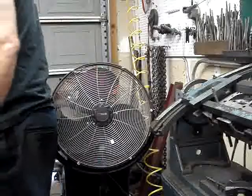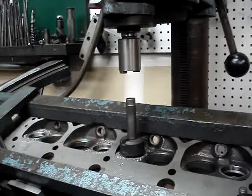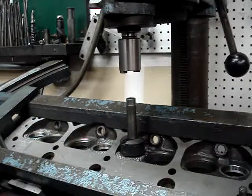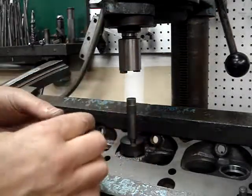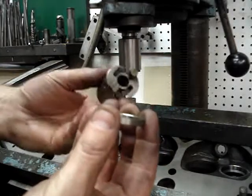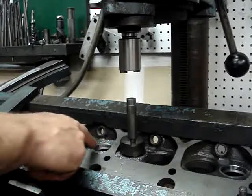So what we have to do — like in this set of small blocks here — we have a cylinder head set up on the machine and what we've done is we have taken and installed a hardened seat insert. We bored that out using a boring tool. This is what they call a counterbore cutter. It's adjustable and we figure out what size our seat is. Now this seat is a press fit, so the seat actually has to be larger than the counterbore. We adjust this so we have an interference fit — our cut is going to be smaller than the diameter of the seat — and then we actually press these into the head.